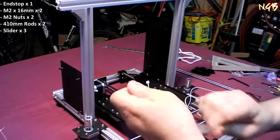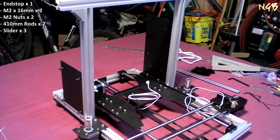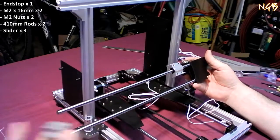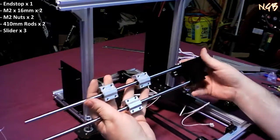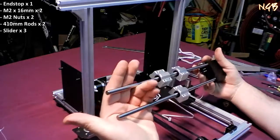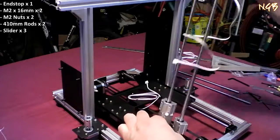and I do realize that when I first said what these are for, I was completely wrong. Two for each axes. No. Three for two of the axes. How's this go? This goes in such a fashion that we have this in this orientation. We have two of them on the top rail, and one of them on the bottom rail. So basically, what I'm saying here is that if you hold this to where these two screws from the limit switch are facing you, like so, you'll put two on the top rod and one on the bottom rod. And there you go. So what you want to do is make sure that these flanges face the same way on both parts when you put that sucker in there. So, do you feel me now?